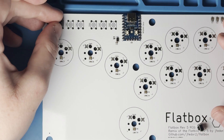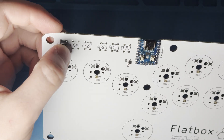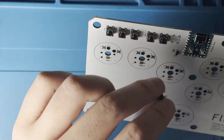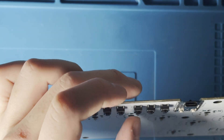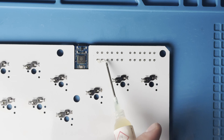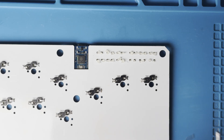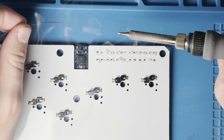We have some buttons to solder to the top left of the board and these are responsible for shortcuts — things like changing the LED colors and opening Steam. Pretty sure you can set these to whatever you want in the Raspberry Pi firmware; that's not something I've really explored yet but definitely something I'll be looking into. Once you push these through to the board I found that they just held themselves in, so I could then flip over the PCB, add some flux and solder the legs in.